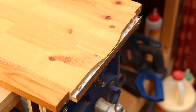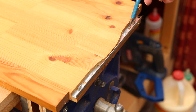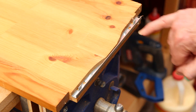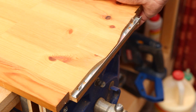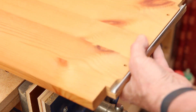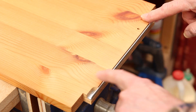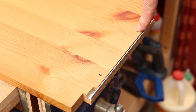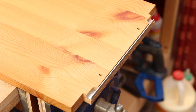Here's another style of fitting where some tangs with points have been punched down from the metal into the wood. You could theoretically cut that and take it out fairly smoothly, but these edges won't be any good for anything. These ones have pretty much the same thing except it's covered, and that tang must be punched through from above — there's no hole underneath. You can't cut that; you simply have to wrench this out.